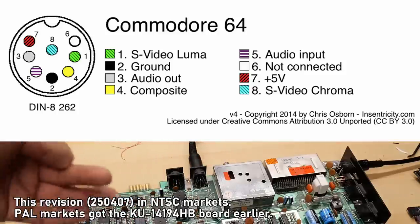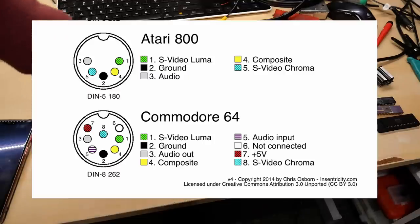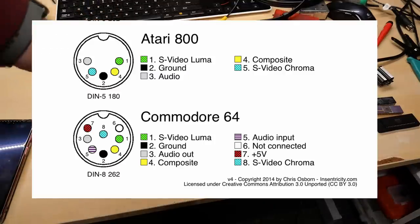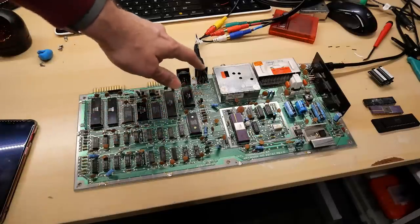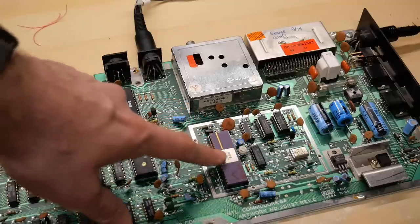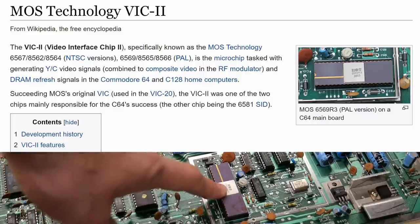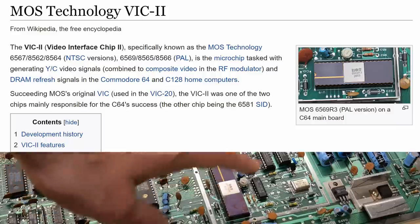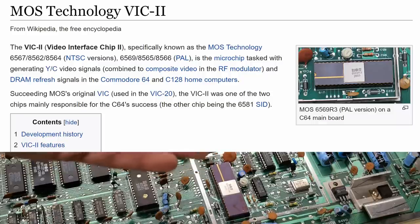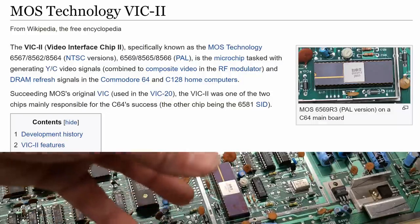That's the equivalent of S-Video before S-Video was even a standard thing. The Atari 8-bit line of computers also had the capability of displaying this chroma-luma signal, although with some of those machines you do have to modify the motherboard to route the signals to the connector. This is the video chip on the Commodore 64, called the VIC-2. It does all the graphics processing and outputs an analog luma and chroma signal. Luma contains the brightness — basically a black and white television signal along with all the sync signals — while chroma is the color information.